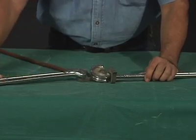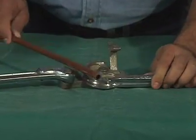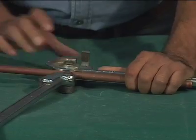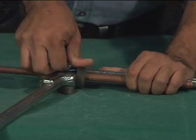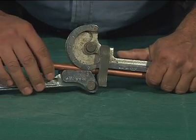With the handles at 180 degrees and the tube holding clip lifted out of the way, insert the tube in the forming wheel groove. Place the holding clip over the tube and bring the handle into the approximately right angle position, engaging the forming shoe over the tube.